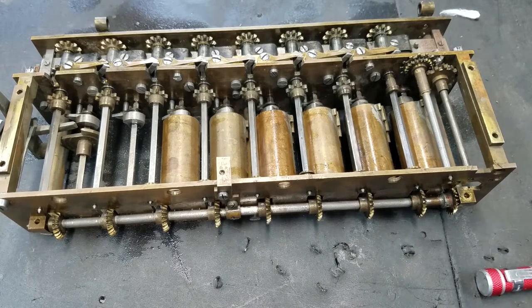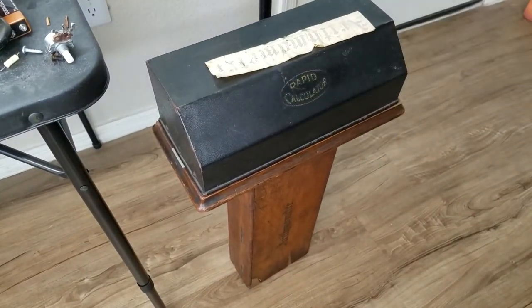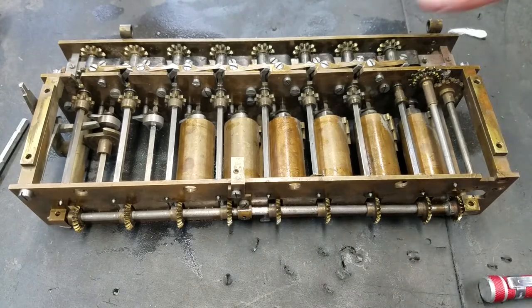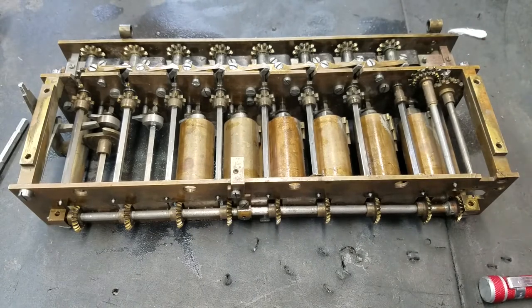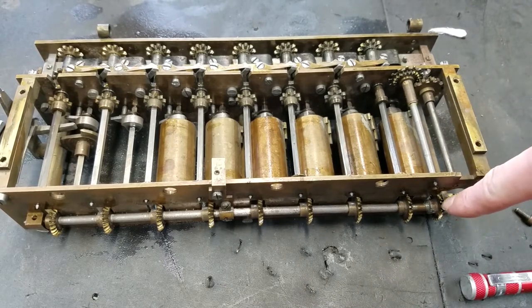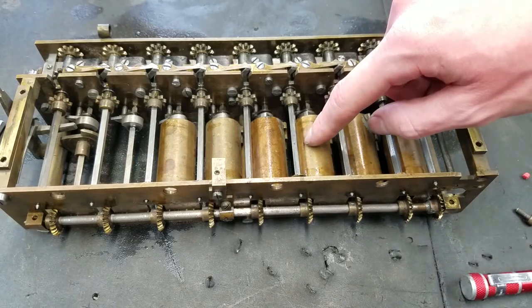I've also been working on the case — I got the side glued back on, with the rapid calculator acting as a weight to hold it in place while the glue dries. With the carriage removed and the input slider part removed, you can get a pretty good idea of the working of the mechanism. This shaft here is the main drive shaft — the crank on the front plate is attached to a shaft that goes down here and has a bevel gear that meshes with this gear, which then drives the shaft all the way across.